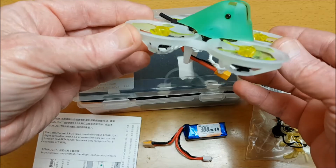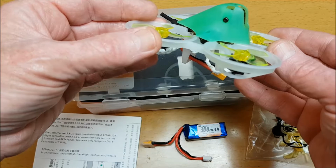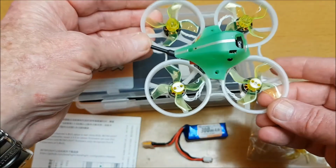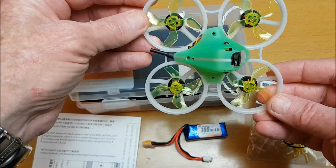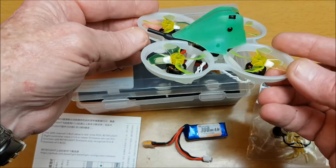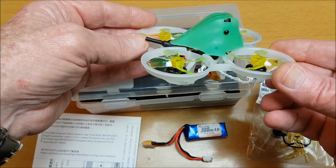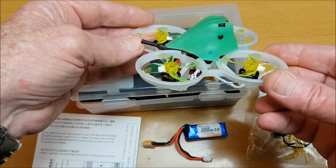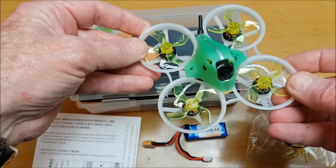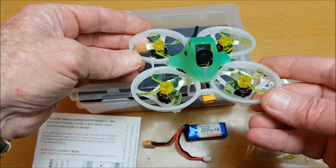This comes with some good components. It comes with a Skystars Coco F405 F4 flight controller with a built-in OSD and gyro. Got UARTs 1, 3 and 6 and supports Betaflight and Cleanflight. Also comes with Coco BLHeli_S 4-in-1 15 amp ESCs with an 18 amp burst current and more caps added to reduce power noise.